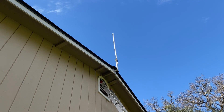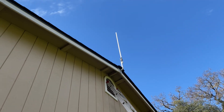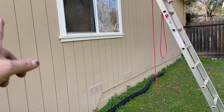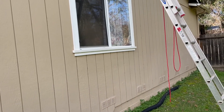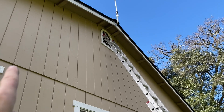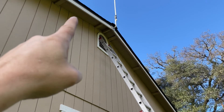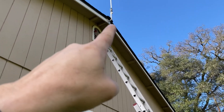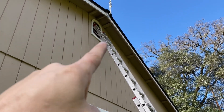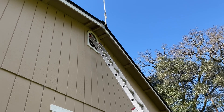I just need to make up the cable. I think I should get up in the attic and push it out. I can pop the screen off, solder the end on out here, go back up and plug it in, then run it out. I want to bring it down and do a drip loop so water won't run into the attic — it'll just drip and then go back up and connect inside the attic. That'll be for another time.